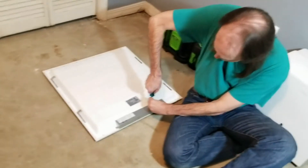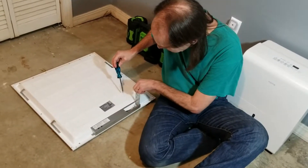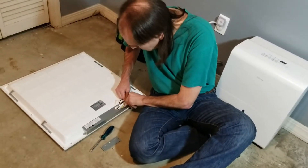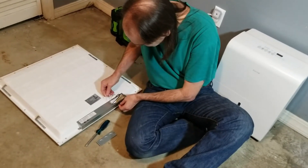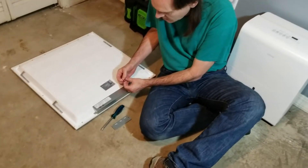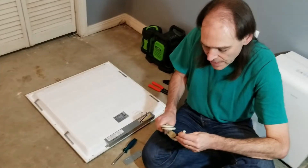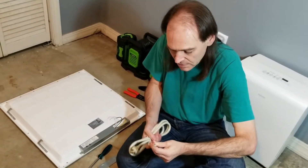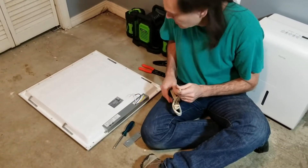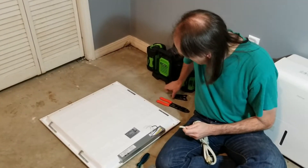You can see there are little punch-outs here — little circles. You can punch one of those out to run the wires in. This is the electrical box where you wire it up. Inside you'll see several different wires: a ground wire, a purple and gray wire for dimming, and a white and black wire. I have an old power cord with a bad end that I cut off. I'm going to strip the wires down, connect them up, and plug it in just as a demonstration — that'll also let me test the different color levels.